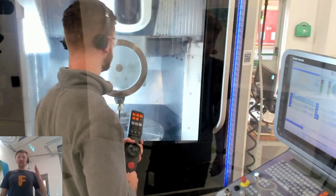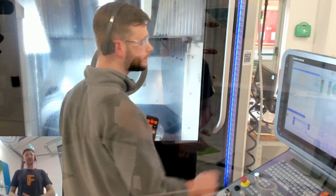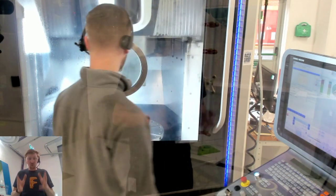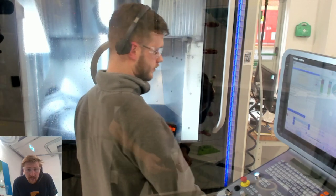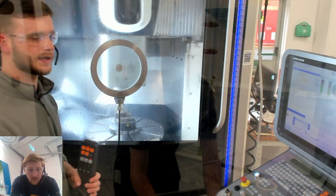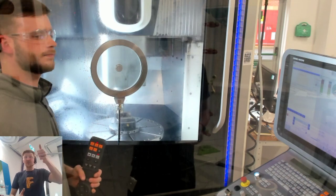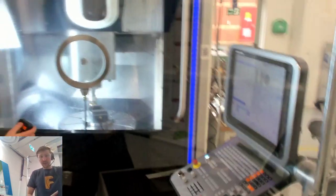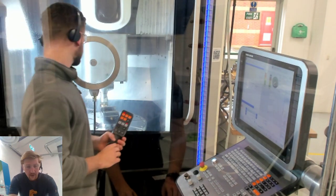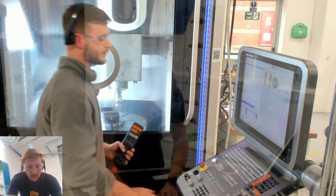And this doesn't matter if you've got Lang vises like what we've got here, Rome vises, or an eBay special vise that you got for a couple of pounds or dollars, setting up this vise is really important. So I'll take the first probing point on the left side of the jaw. Hopefully you can see that a little bit, Rich. Let me move the camera a smidge, because your VisiPort's in the way. There we go. So I've taken the first point on the left-hand side of the vise, and if we move over as far as we can go and then take the second point,